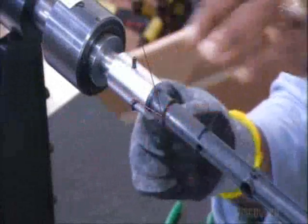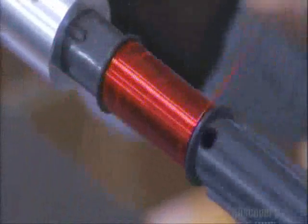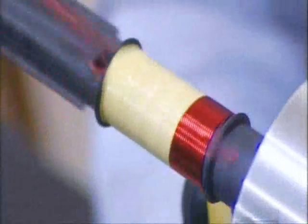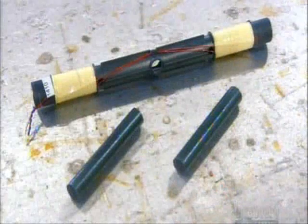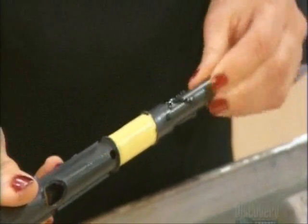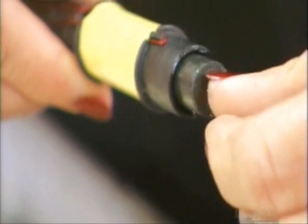To make the coil, they use copper wire coated with nylon insulation, wound around two ends of a plastic bobbin a specific number of times. Polyester tape keeps it from unraveling. Security metal detectors need pure iron glued into the bobbin to increase the magnetic field strength. Without it, the coil would have to be several times larger and wouldn't fit inside a handheld wand.